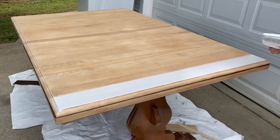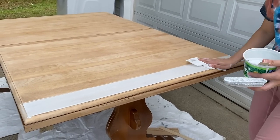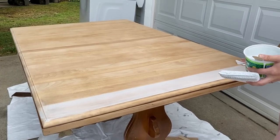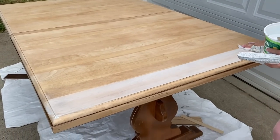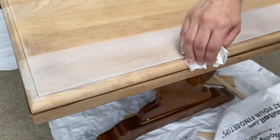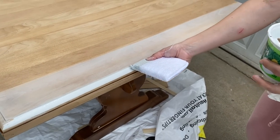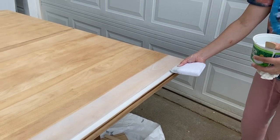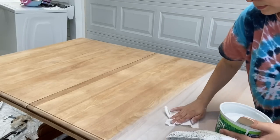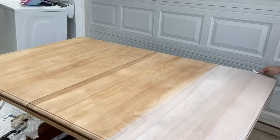Because what you run into when you do it my way here as a solo man is it dries a little quickly, and then sometimes you'll have lines, which is fine when you have this wood that has lines in it as well. You know, there's going to be a lot of variation in the finish. But if you're going for something that is all one solid piece and you don't want those lines in it, like I said, it would be awesome to do this as a two-person job, or to figure out how to do it where you were painting it on and wiping it off and painting it on and wiping it off. I don't know. There needs to be some invention going on here, but that is what I did. I'm gonna whitewash it and then do some brown on top of it.